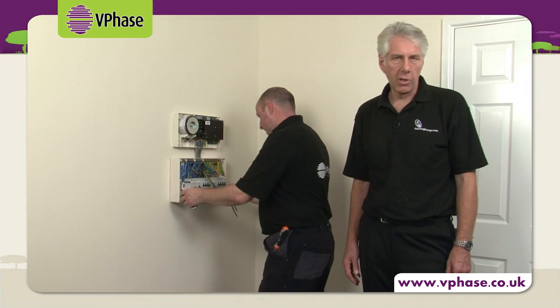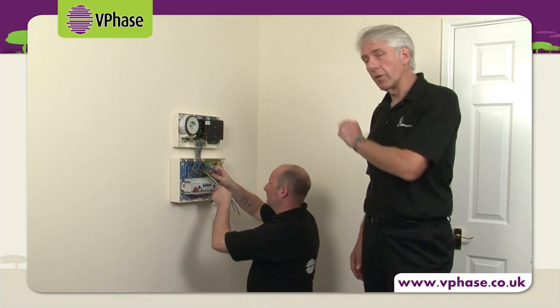Now for step 5, we need to reconfigure the board to accommodate the 50 amp breaker and arrange the optimised and non-optimised circuits. It's good practice here to make sure that neutral and CPCs are also adjusted to the appropriate terminal in the board.